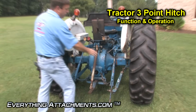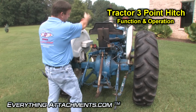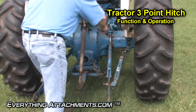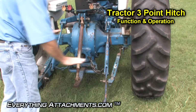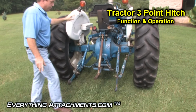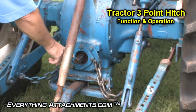On almost all tractors, the right-hand side, and a tractor is always viewed left or right from the operator's position looking forward. So this is the right side, and it has an adjustable side link here, and that's what you're going to use to tilt or angle your box blade or get it level or whatever you're trying to do. This is your drawbar, and that's what you're going to pull like a baler or something with or put a hitch on. This is your 540 RPM PTO.